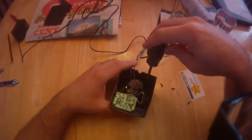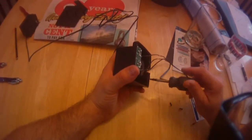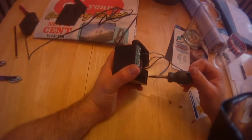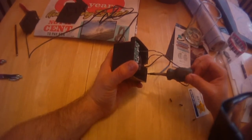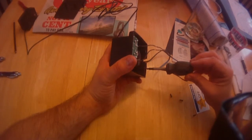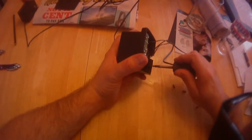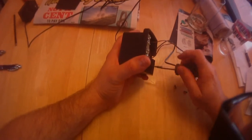If it's something expensive, then you're really upset. You want to make sure you're pulling into the existing thread. So turn the screw backwards like this until you feel the screw pop down. If you do that, you're always going to be guaranteed to get it back into the existing thread.